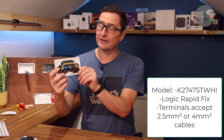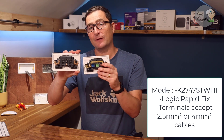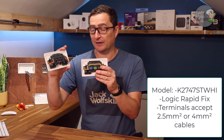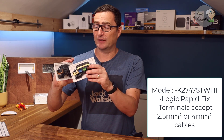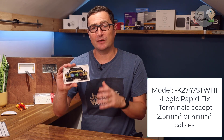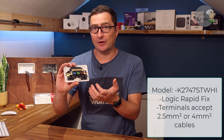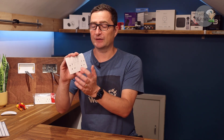The clamp on the back has a little lever and it is so much better than the screw type you see on the standard MK socket, which has three screws on the back. This one has clamps, so it's much quicker and easier. It's also got three terminals on the live, neutral, and earth, so you can use two for your ring main and the third to extend later.